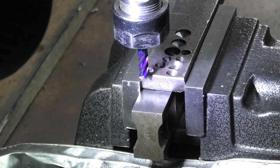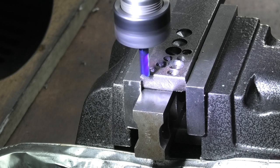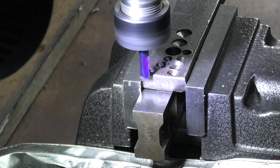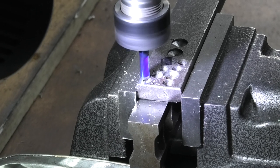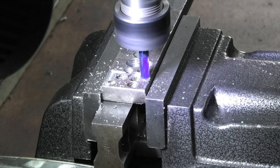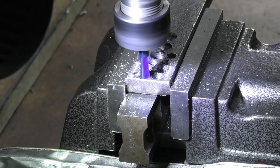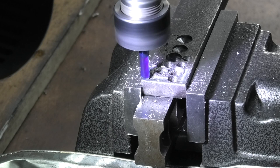Fitted the end mill in the milling machine — it's a small end mill so I think we'll run that at about a thousand RPM. I'll just put a cut on and run it along the top to remove the scale. Lower the tool to cut some more off.